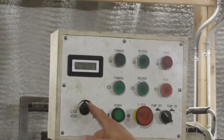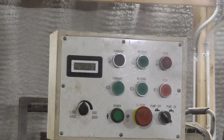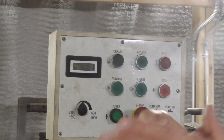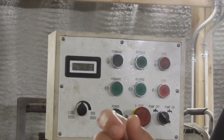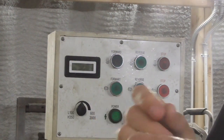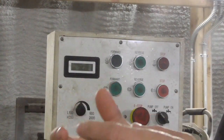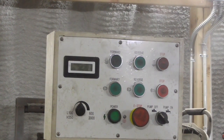The issue was with the potentiometer that controls the spindle speed on the control panel. Originally the machine came with this multi-revolution potentiometer, and I had a problem once before where a wire inside that potentiometer — the one that connects the moving wipe to one of the terminals — over time the connection fatigued and the wire broke. That first time I actually took the potentiometer apart and soldered the connection back together, restoring original functionality.